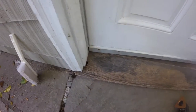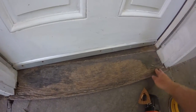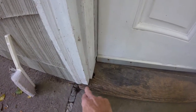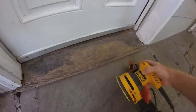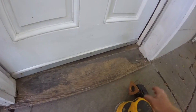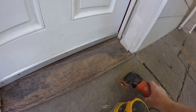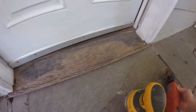But if you notice, for the most part it's in pretty good condition, except for along the edges where the water has sat on it, and then of course over here where it's got that hole. So what I'm going to be using will be a sander to take off the surface, just the surface of it. And then I'll be using this multi-tool to get in along the edges, places that the sander won't be able to get me to.